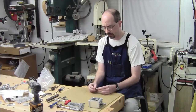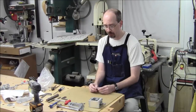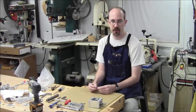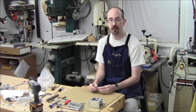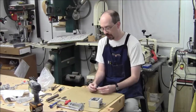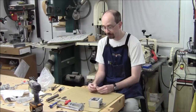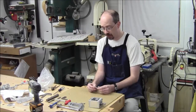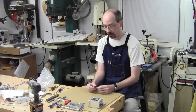After annealing the shank, the die ran a little bit better, but it was still terrible. I started to realize I probably shouldn't be threading this, because threading isn't going to guarantee concentricity unless I just thread it on and then turn it. I'm getting more and more to the point where I'm running out of material — now we're at eight millimeter, or very close to it, actually closer to seven. I'm going to abandon the idea of threading because I'm running out of shank and I think it's as big as I can keep it.